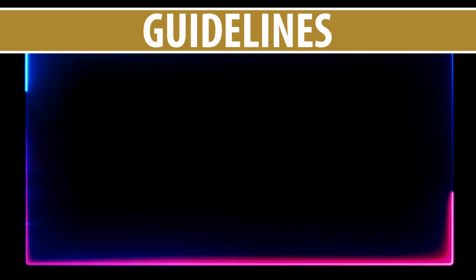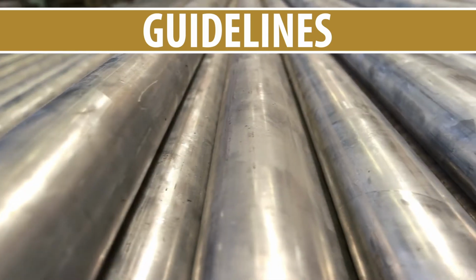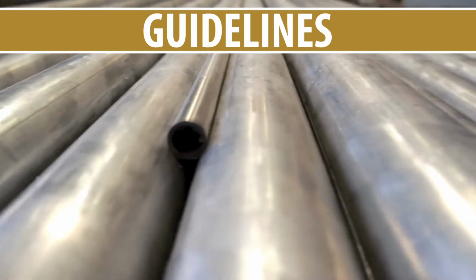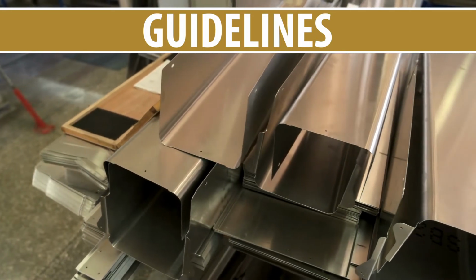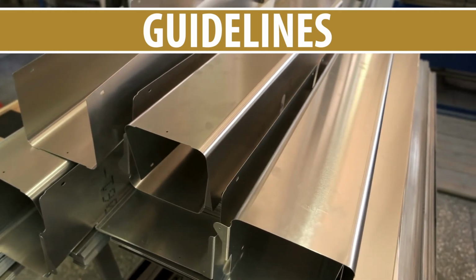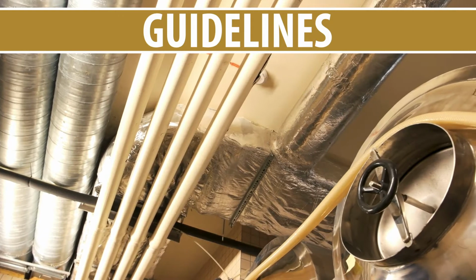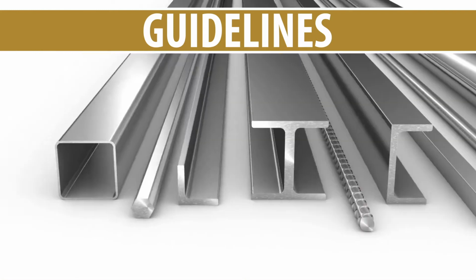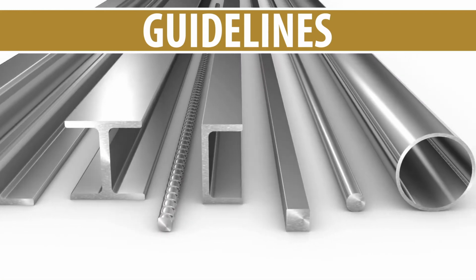Sometimes it's necessary to think outside the box when confronted with a difficult hearing loop system design, but here are some good basic guidelines. The antenna should be consistently the same height throughout the installation if possible. Metal in the structure will absorb the magnetic hearing loop field and distort the shape. The size of the loop segments may need to be reduced if the output is unacceptable to the users or does not meet the IEC standards. For the same reason, the antenna should not run parallel along metal structures like ductwork, metal pipes, or steel framing. It can cross over these structures.